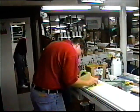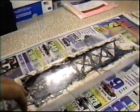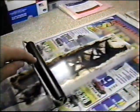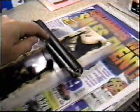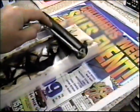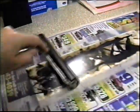This is the final part with all the carbon in it, all the resin oozing out. As soon as Les gets his gloves off, we're going to roll it and put it under some heavy weights. Notice that we've got overage in every dimension here because the more carbon we can squeeze in there, the more you can get out all the little air bubbles this way. All right, let me roll. We'll put a weight on here.